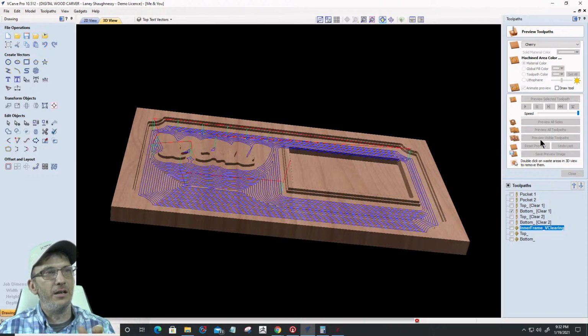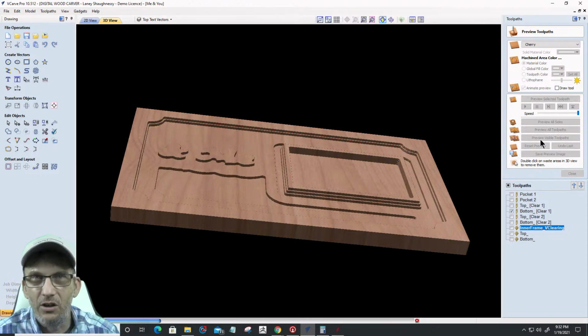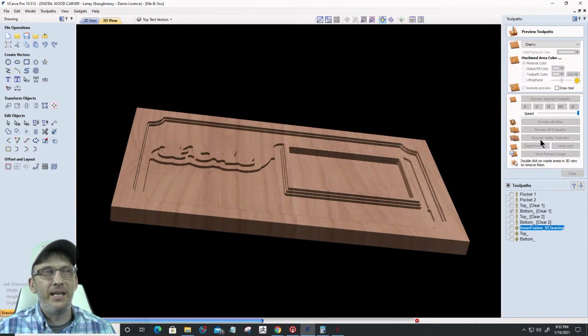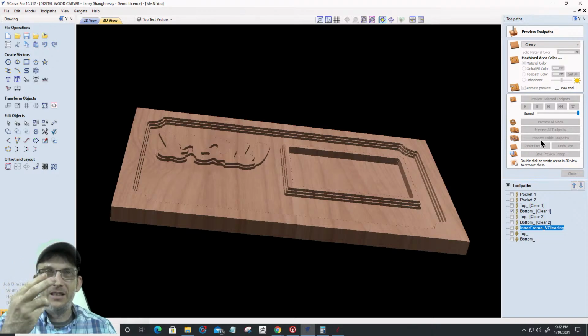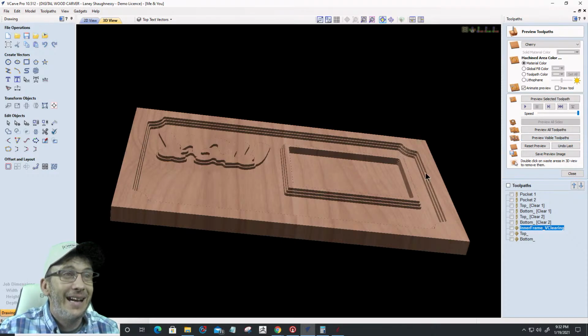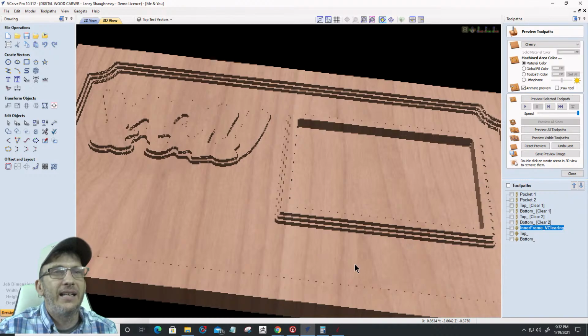And you'll see it here right now. There's my third step. Remember I was saying earlier, like an hour ago, that it's going to do a third step, and then when it didn't, I was like, oh no, it's not doing a third step. Why? I knew there were supposed to be 3 steps there because it's 3/8 of an inch passes, but I didn't have that clearing vector created, and I didn't have the proper offset on that bottom welded text layer. Now, this should cut exactly like it's supposed to.